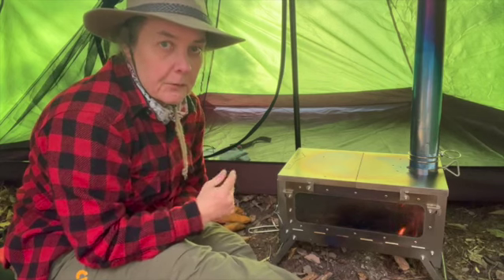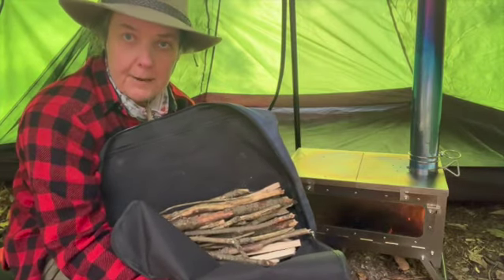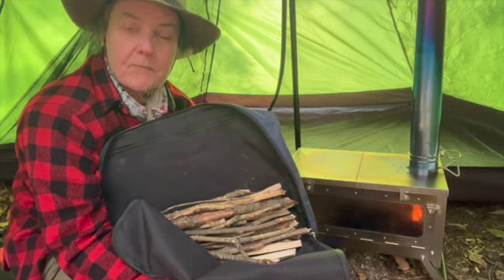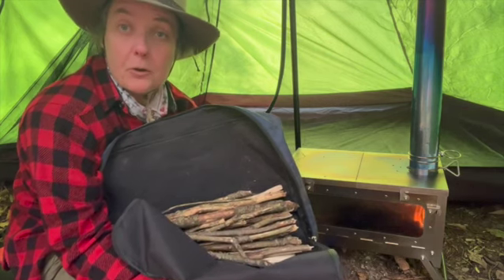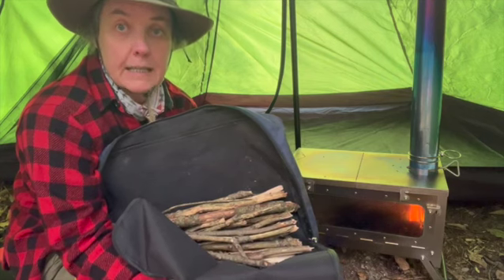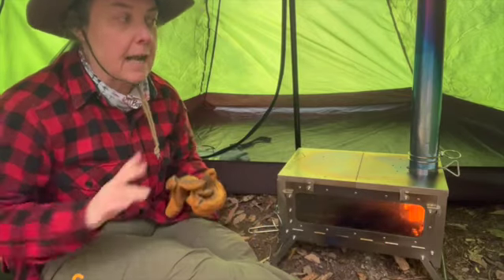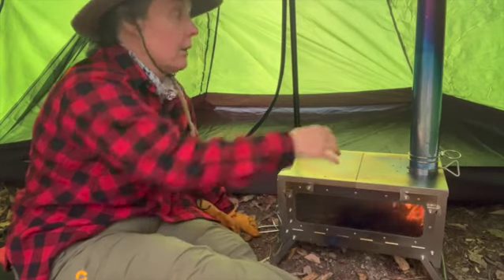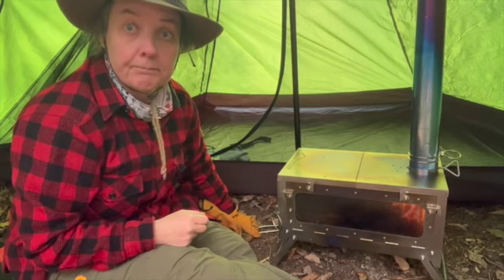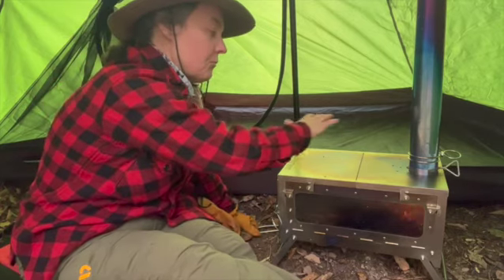Another complaint I've heard is: 'Oh god, they burn so much wood.' See this little thing here? When I've got this full of just little twigs, leaves, and storm damage wood, that's enough for the stove to run a half hour to an hour in the morning and evening — and that's all I want. I suspect what's happening is people leave the damper open because they don't know how to efficiently run a wood stove, and all that heat goes right up the stove pipe and outside.